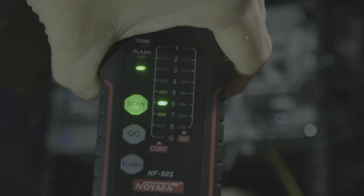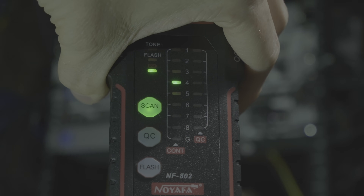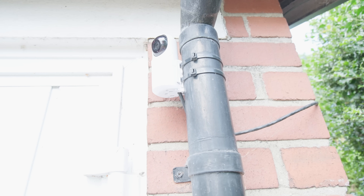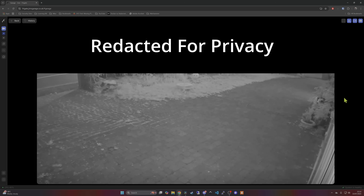Looking at it now I think we're okay — each light is blinking through. There did appear to be some issues with a double blink, so I double-checked and rewired the cable to resolve that weird double blink on pins 3 and 6. I then passed the cable through the airbrick to the outside of the house, making sure it immediately dips so there's no water ingress following the cable line, and wrapped it round to where I was going to seat the camera. A quick check in Frigate confirms the camera is up and running.